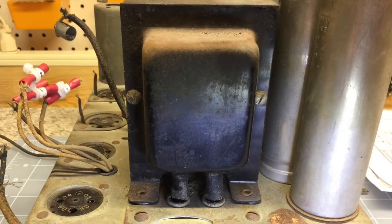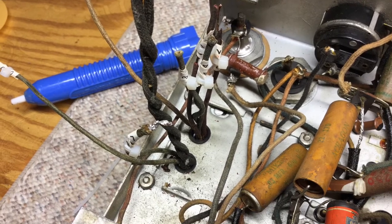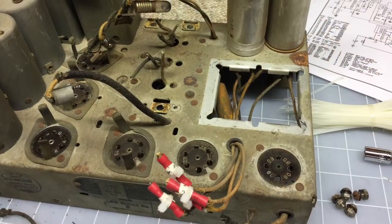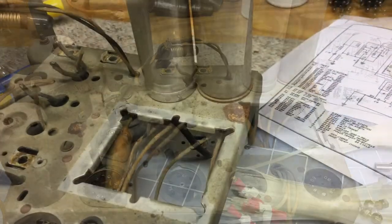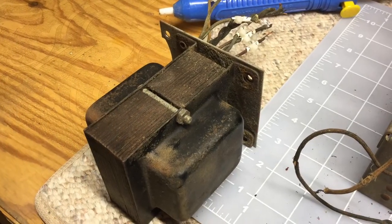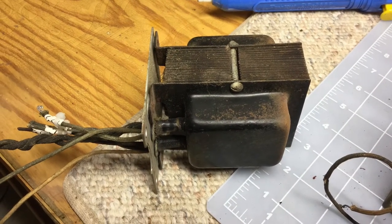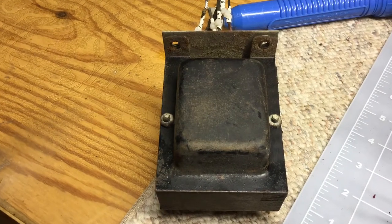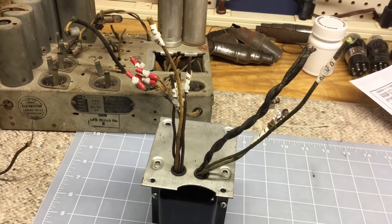The next thing I did was get this old power transformer out. I had already checked it and it looks good — I'll double-check it again. You can see I'm taking time to tag my lines, followed by the schematic itself and also a hand drawing of every connection point, which is always important. The old power transformer came right out with no issues at all — just four small screws and nuts holding it to the chassis. Here are a couple more photos showing the extent of the rust. One side of the transformer is in really bad shape. You can also see my nomenclature for tagging the lines, which matches my hand drawing and ties back to the schematic.